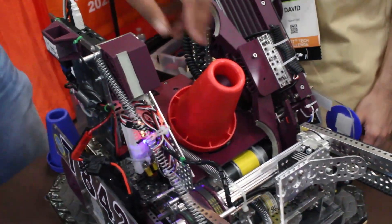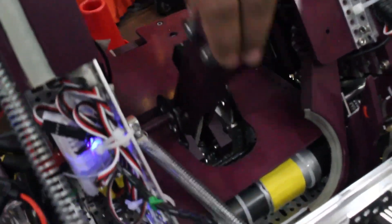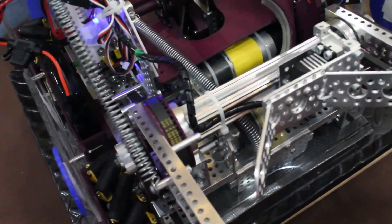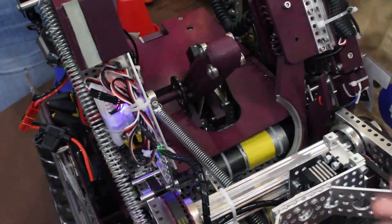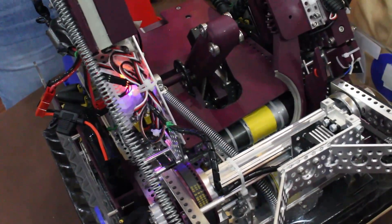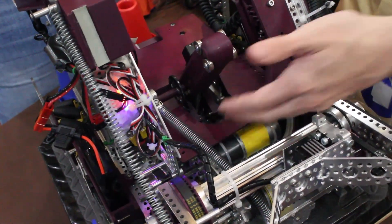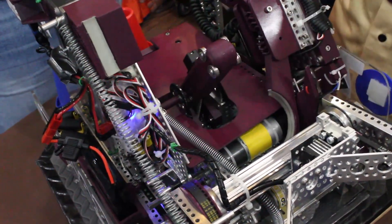There's a bunch of little features going on here. I see some springing going on here — was that something that's always been there or a recent addition? Now with this middleman, we do need a spring so that it comes back to its position to put more cones onto it. Yes, we've had the spring, but now there's a huge spring on here because we needed more spring force pulling it forward so that cones wouldn't get stuck inside the robot. We just recently added this larger spring, but we have had the spring on this since we designed it.